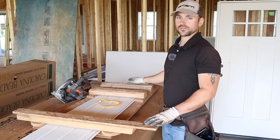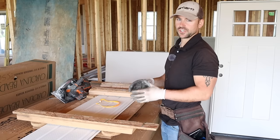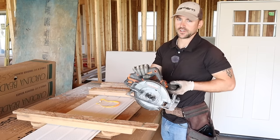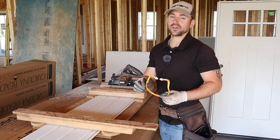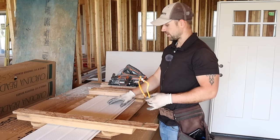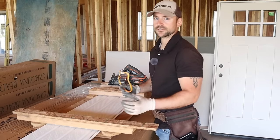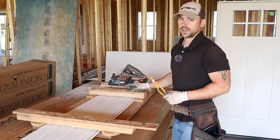The second method I like to use involves a soffit jig. I'll put a link to a video on how to make this exact jig. This involves a circular saw — in this case a battery circular saw with the blade turned backwards so it doesn't damage the soffit, because it's too aggressive the regular way. Wear ear protection because it's super loud. This soffit comes in 12-foot sheets, so you can get 24 pieces by doubling up two sheets — each cut gets you two feet of soffit. It's very fast and portable.